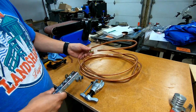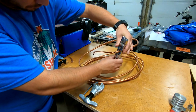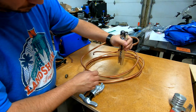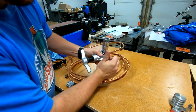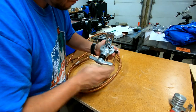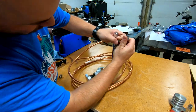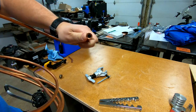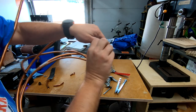If you are not comfortable doing this on your own, this is not the type of DIY that you risk it, because propane is explosive. So be careful. The propane lines are connected using a flare fitting — this is a specialized tool that you likely won't have in your average DIY kit, but you should be able to find it at most local hardware stores. To make the flare end, you first put the fitting on, then clamp the flaring bar in place. Then you can tighten down the flaring adapter. The tool I have is designed so that you can't over-tighten it, which is a nice feature. After it's been tightened all the way down, you just remove the yoke assembly and the flaring bar, and you have a nice cone-shaped flare. Before trying to install this line, I cut it to approximate length using a standard pipe cutter. This will make it a lot easier to deal with in the next step.